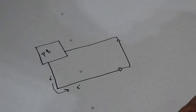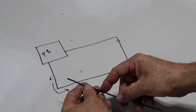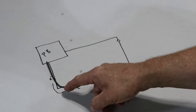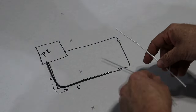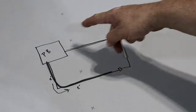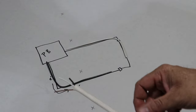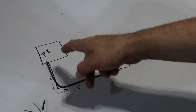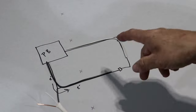I'm going to leave the ground out for now. Your black wire is what hooks up to the breaker in your panel box. Essentially you have one wire that comes over to a device that powers your device, and then you have the white wire that returns the current back to your panel box. This makes your loop and all of this is accomplished through one wire. Whenever you wire something, you're just going to run this jacketed wire from the panel box to whatever you're trying to power, and through these wires this will make your circuit.